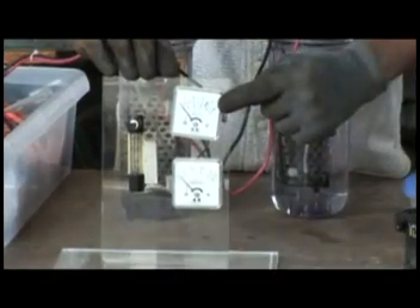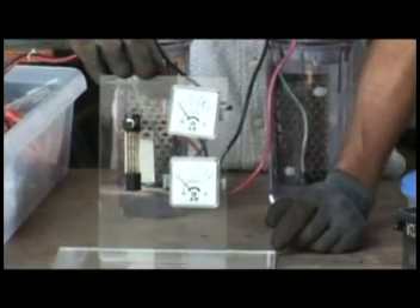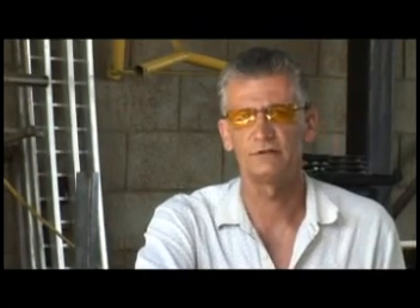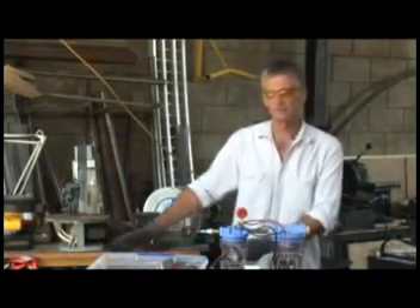On this little plexiglass panel we have a couple of gauges mounted — actually three. One is a volt gauge, the other is an amp gauge, and the other is an airflow meter. The airflow meter will tell us how much hydrogen we're putting out. The volts will tell us the voltage, and the amperage will tell us how much current we're flowing. You can multiply volts times amps to get watts, which is a measure of power — we're going to do that later. It's time to introduce our power supply, which is a 12-volt battery.